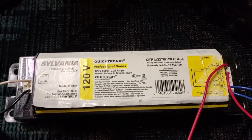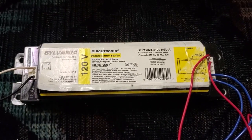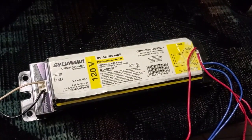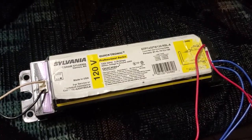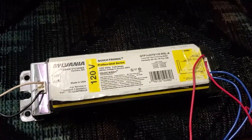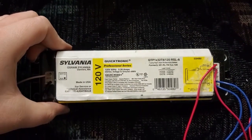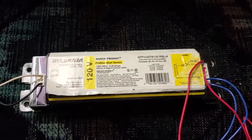One of the first things you notice is that the open circuit voltage is only 350 volts. Most modern electronic ballasts are 600 volts, if not more, at least for four-foot lamps. So the difference between these early ballasts and modern electronic ballasts is that these do not start the lamp instantly - the lamp actually has a little bit of time for the cathodes to heat up and properly start. From what I've read, lamp start on these ballasts is actually not too different from a magnetic rapid start ballast. This ballast comes from a time when the magnetic ballast was still king - these were very much a specialty item.